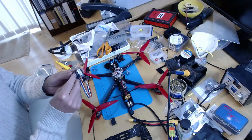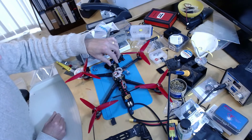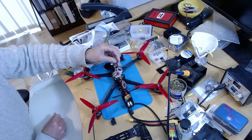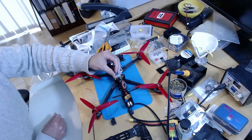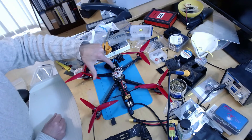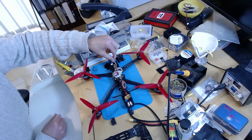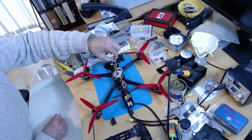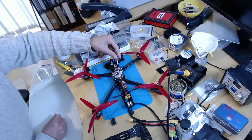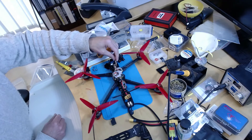The offsets for the BMM150 mounted in position were far higher than on the bench. I've now soldered up the other GY271, put heat shrink on it, and I'm going to mount it in the same place. It calibrated to about 5.6 fit, but the offsets were higher than expected. I think there are magnets in the buzzer interfering with the compass - but that should just be a fixed offset we can cope with, and the much better fit for this sensor should mean it works well.